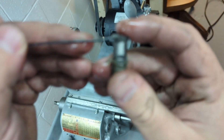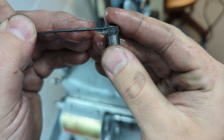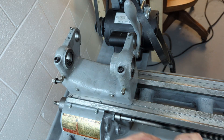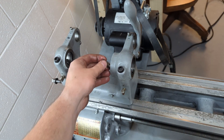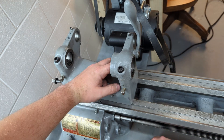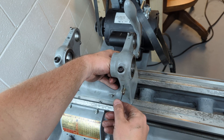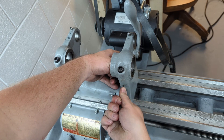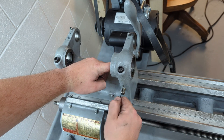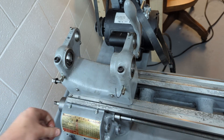What we're trying to do is push this down below the journal, and either get this above or get it jammed into the felt so it holds it down. If you don't do this, the spindle is going to catch as you feed it through — it's going to tear, it's going to get stuck. So put the felt in, push this absolutely as far down as you can. Take your pointed wire or needle, whatever you have, and just gently jam it in there. Just keep trying until you get that felt below. There we go. That's one.